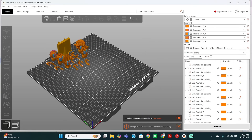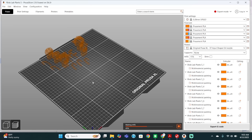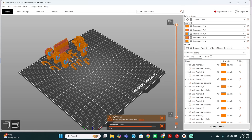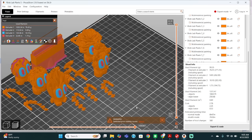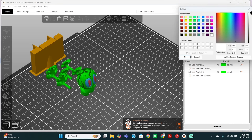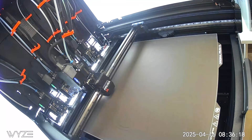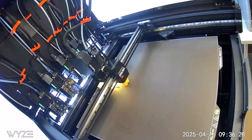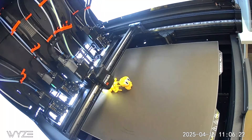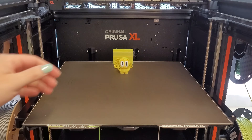These printed pretty good — they don't have too much stringing and I don't see any weird color strips. But I want to see if I can make this faster and better, so I'm going to run this on the Prusa XL and compare overall how it works. I start with all five variations, and this will take just under eight hours — a huge difference. For just the single Monstera, it's going to take under three hours. I've flipped my colors, so my darker and lighter green are the opposite of what I wanted, but it did print okay so I let it continue.